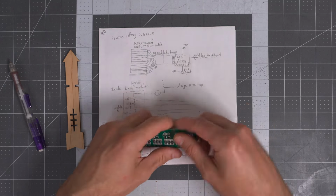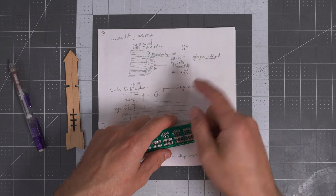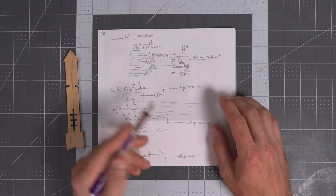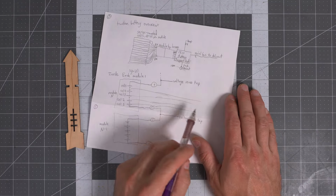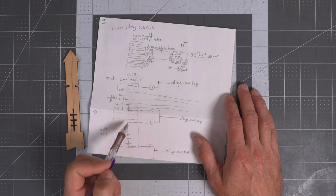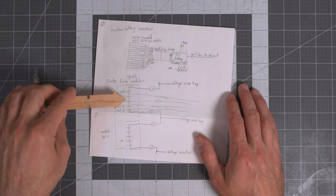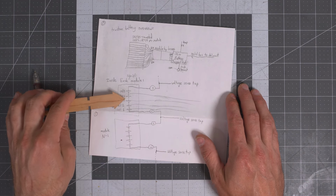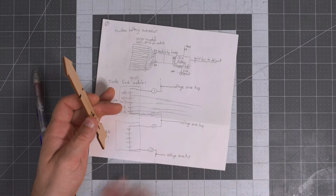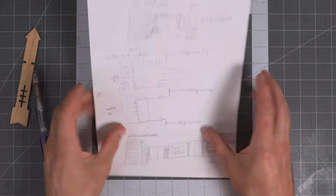Again, it's going to have a central thing. I'm going to replace the entire battery support unit, and it's going to become a battery management system. And of course, we're going to have to replace the harness. Here I am repping my own brand now. But anyway, if we route all of these cells out, then we have a single computer, this battery management system, that can look at every single cell. And once it can do that, it can make decisions based on every single cell. So if a cell gets full or empty, it can tell the car, hey, stop charging, something's wrong, however you do that.